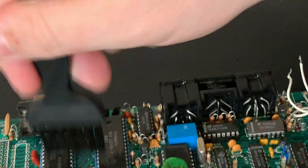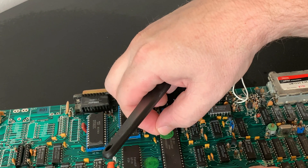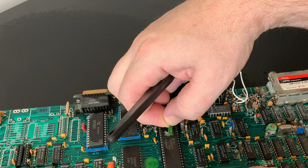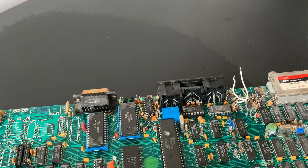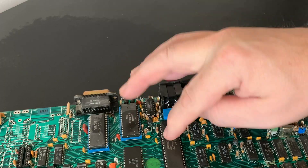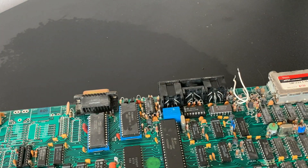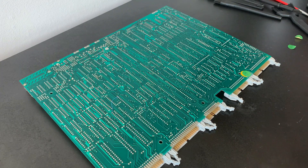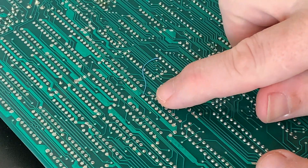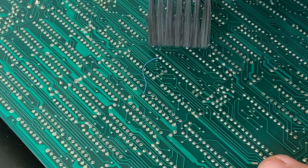I am, however, going to remove these stickers very carefully just in case. I couldn't find anything on the internet referring to Jude or Judith in association with these machines, but if you know otherwise please leave a comment and I can pop them back in. We'll also give the underside of the board a good scrub, and it's a good idea to always be on the lookout for small patch wires on these older machines, as often things were fixed after the final designs had gone to the manufacturers.